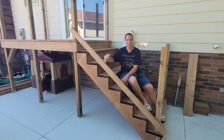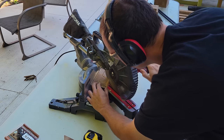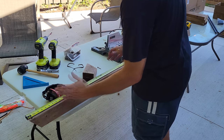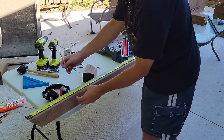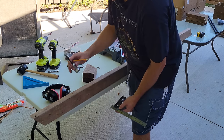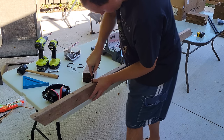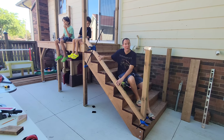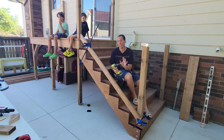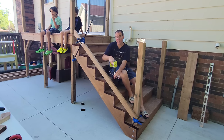The spacing you want between balusters is four inches, but because of the angle of the stairs it works out to five inches. I've got three inches extra on the end so I'll move everything over one inch, starting at four inch, nine inch, fourteen inch, and so on. With my combination square set to three-quarters of an inch, I'll mark the center of the board and use my awl to put a divot so the bit doesn't wander. Then we'll put this up on the stairs and drill out the three-quarter-inch holes with a self-feeding spade bit going about an inch and a quarter deep. I've got the bottom rail clamped to the post at both ends so it can't move while drilling. I'm configuring my drill this way to keep it perfectly plumb.